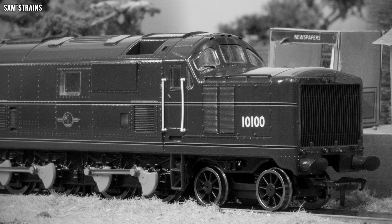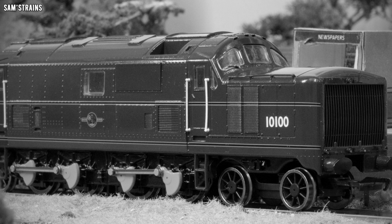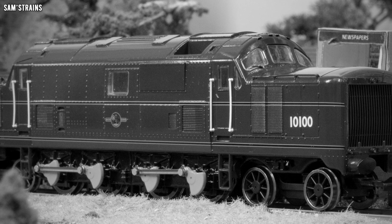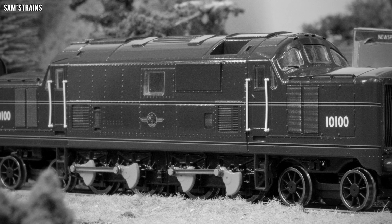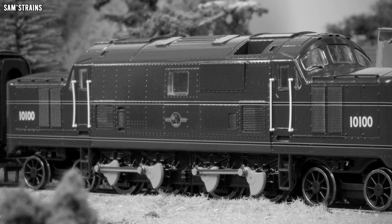The main gearbox was driven by no less than 4 different engines connected to it by hydraulic coupling. Each of these hydraulic couplings could have the fluid pumped in or drained out of it in order to connect or disconnect the engine from the gearbox. The gear ratio and resulting torque was actually dependent on the number of engines connected.